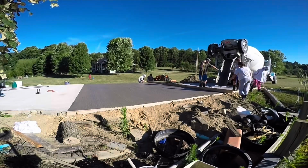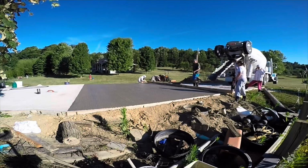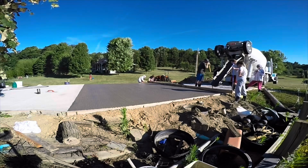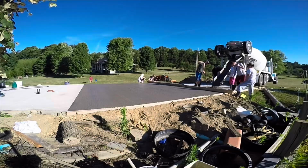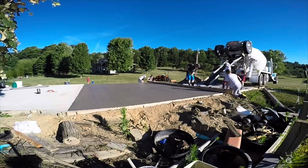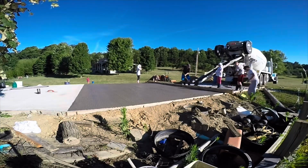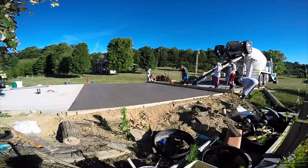You saw me several times pull up during this video, pull that rebar up. You want to make sure that someone continues to pull that rebar up a little bit. There I was pulling it up. You need some concrete under it, so as you pour the concrete in, you can pull that rebar up a little bit, and then it'll sit on that concrete. And you want it to be on the lower 1/3 or in the middle. You don't want it just to lay on the bottom. You don't want to pull it up too far to where it's up close to the surface either.